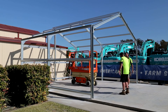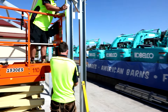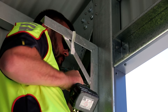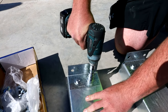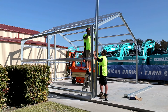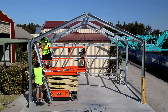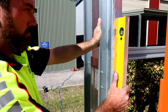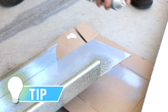Flick a chalk line on the foundation in between the columns, then mark the position of the roller door post or posts as per engineering plans. The roller door posts are installed in the same line as the end portal frame. End roller doors are supplied with C-section roller door posts; the web side (flat side) of the C-section will face into the building to provide a surface to mount the roller doors to. Fix the base cleat to the bottom of the roller door posts and tighten bolts as per engineering plans. Stand the end wall roller door post onto the marks on the foundation. Plumb the post and clamp to the rafter. Mark the top and bottom sides of the rafter onto the column, then bring the post back to the ground and notch the post creating a bracket utilizing the waste material. Stand the post back onto its marks, plumb and clamp the top to the rafters again. Drill holes through base cleats into the foundation and secure with appropriate anchor bolt as per engineering plans. Double check mullions are still plumb and fix the roller door post to the rafter as per engineering plans. Tip: Spray all cuts of galvanised columns or posts with cold gal to prevent any corrosion. Sidewall roller doors will use Z sections as roller door posts.